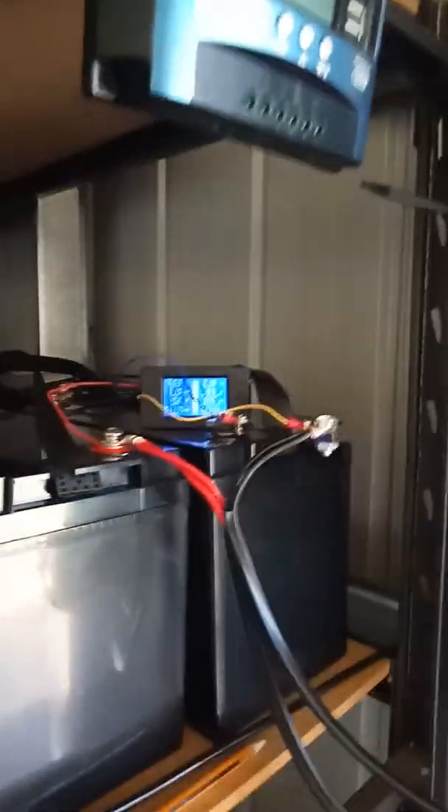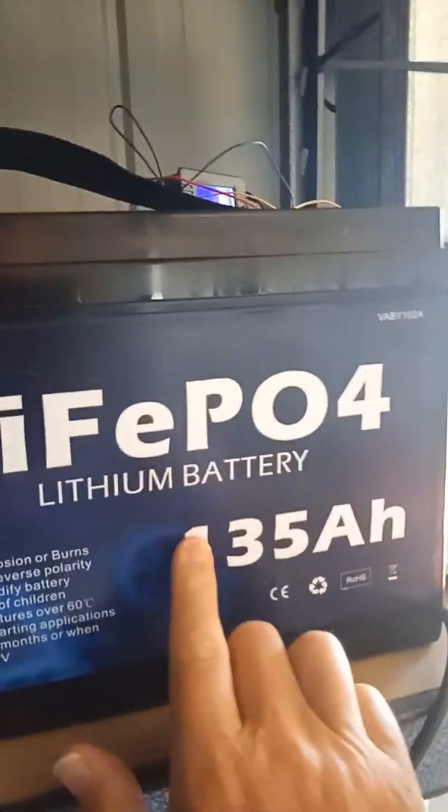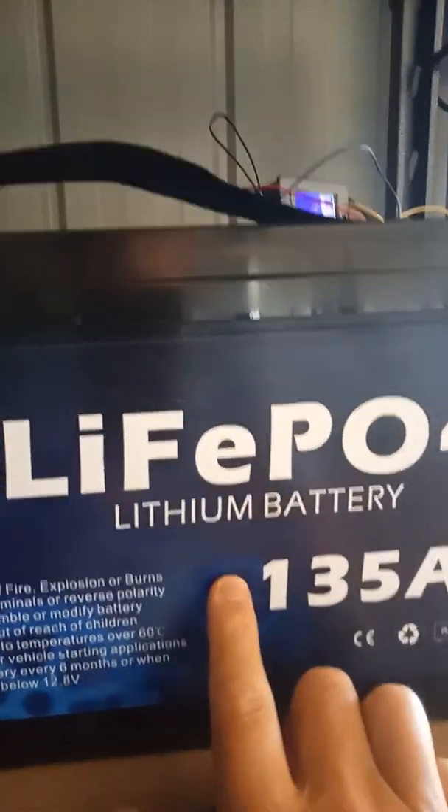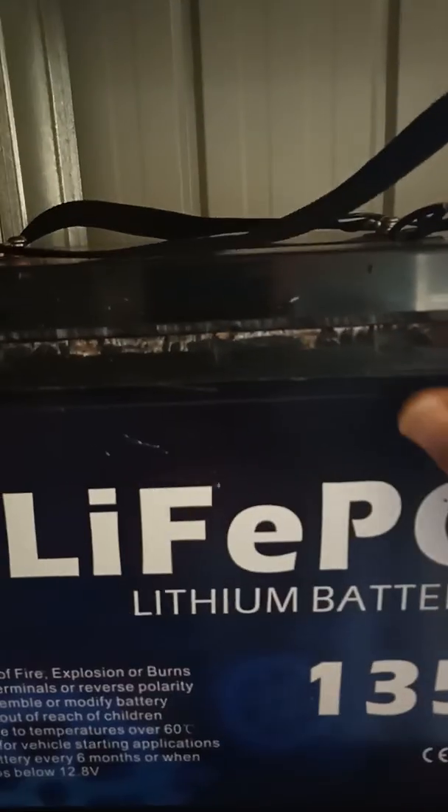Currently I am working with these four batteries. There's a nice meter there — excellent device, highly recommended. These batteries, not recommended. These are from Australia. They're marked as 135Ah but they're not — they're actually 75Ah. So I pulled one apart earlier to have a look inside, because this one wasn't balancing as high as the other ones. So I've charged a spare extra so that it stays online.